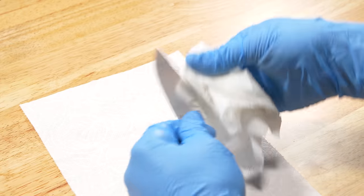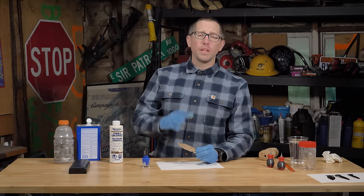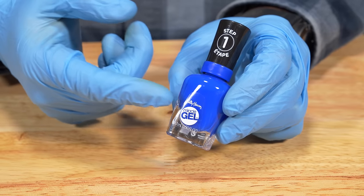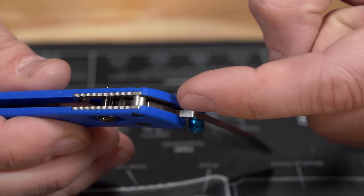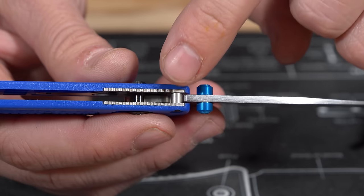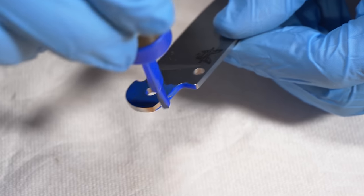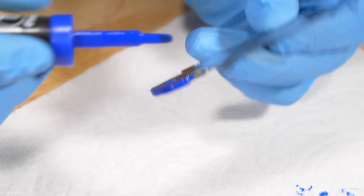You want to make sure that you clean your blade or your piece really well — any imperfections that you leave here will show up after the acid etch. Now that we have our blade nice and clean, we want to use some nail polish to paint off all the areas where our knife will be contacting bearings, detents, lock bars, anything of that nature. A brighter color is better so you can see where you've applied the nail polish and make sure that you are protecting those places where tolerances are important.